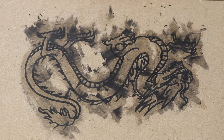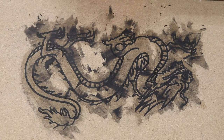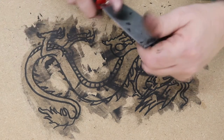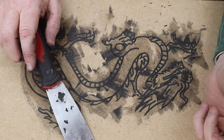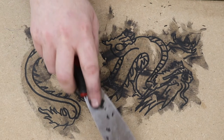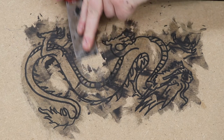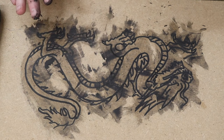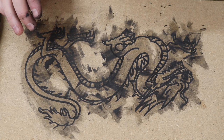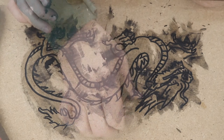We've probably already worked out that we're going to have to sand this down. But using a bit there, I found the best method for squeezing it in is using a scraper, paint scraper or a spreader or whatever. And don't cut it underneath and take it off, because it just pulls the stuff back out. Is to push down and drag it. It will take off the excess and it will apply pressure to the grooves. And there's some areas you might need to do more than once, but on the whole, it's come out quite well. I think that's done.